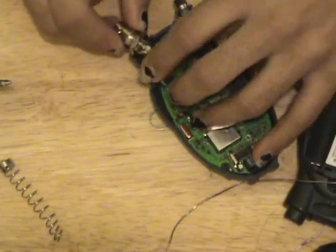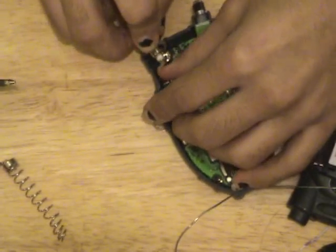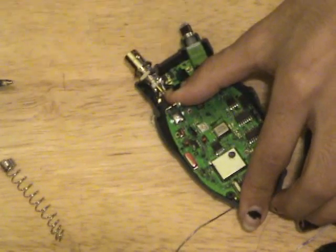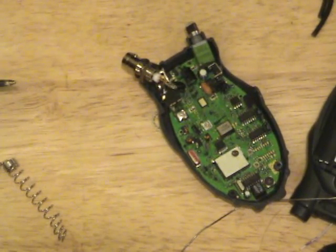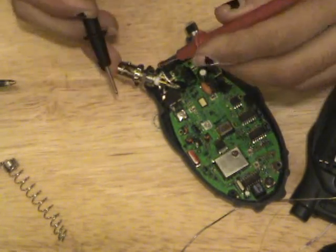Reason being is we don't want the BNC connector to push in too far. Now you got to remember, you do not want any of your signals and ground leads short-circuiting. That'd be really, really bad. Now at this point, I would just slather a whole bunch of hot glue in here. I'll do that off camera. We'll reassemble it. But even before you even go to the hot glue method, where's my multimeter? Make sure you don't have your signal and your shield shorted.